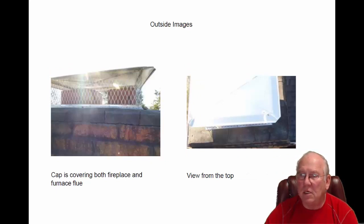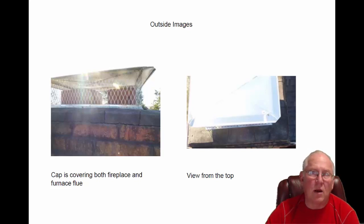Looking up on top, we can see it does have a stainless steel cap covering both the fireplace and the furnace flue. But we can also see the cracks up here where water is still probably getting in a little bit. My recommendation for this, the shoulders, and any places where there are cracks in the masonry is to fill those cracks with good silicone caulk to keep the moisture out. Silicone caulk will definitely hold up for you since you don't get a particularly high amount of heat up there.